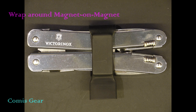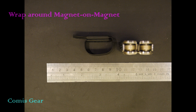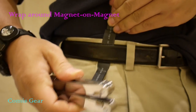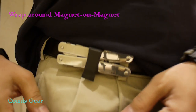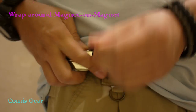This is probably my favourite of all solutions — very clean looking and user friendly. Find two or a few really thin rectangle-shaped magnets, install them into a thin strip of heat shrink wrap, then just wrap the magnetic heat shrink wrap around the belt and the tool. The key is to find just the right minimum amount of magnets for it to work, but make sure the height of your magnets is no longer than the width of your tool, and the length of your sheath is just right so the heat shrink wrap hugs the tool tightly from top and bottom. Beware the direction of the magnets when installing — and don't ask me why I know. The drawback is it's very tool-specific, and you'll need to make a loop after removing the tool so the sheath won't be lost. Since material is minimal, I'm not sure it will work well for the longest or heaviest full-size multi-tools.